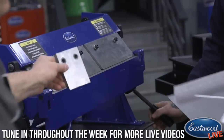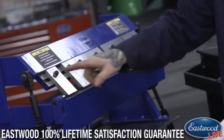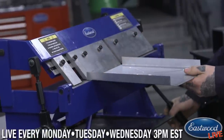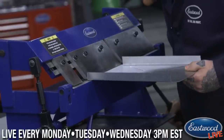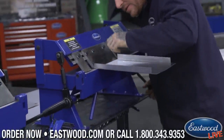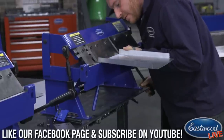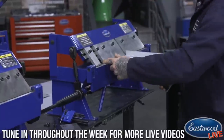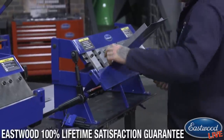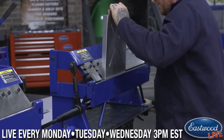The fingers are removable — we took one out and moved the others around, sliding them. We stacked a small one and got lucky that it spanned almost exactly the area we needed. If it doesn't span perfectly, you can leave spaces in between fingers — sometimes you may use a bunch of small ones with small gaps, and just try to match up the corners. As long as most of the piece is being held down, it's going to follow the bend through. You can also set the fingers further back if you want a more gentle bend. That got us just a little over 90 degrees.